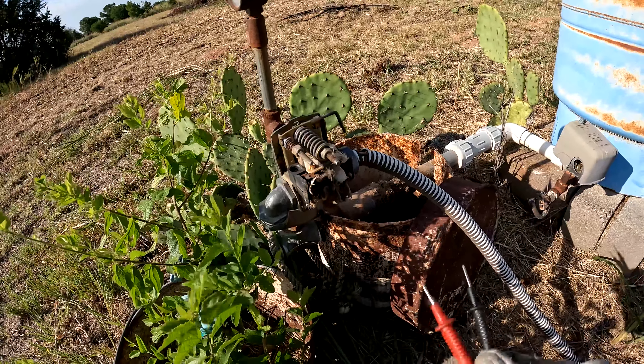The whole point here is that we get power all the way out to the well head but not to the pump — I'm really excited about that. It's been a week; I come out on weekends to work out here and we're back at the well. I've kind of fixed the breaker — pushed the pins in so it wouldn't fall out. What we're going to do is bypass the pressure switch and tie the two wires directly to the pump to see if the pump even works and if we get water.